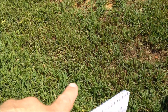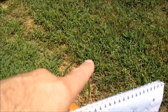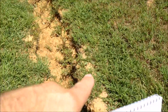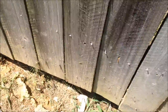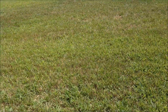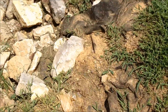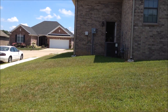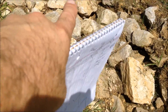Over here on this side we'll put another grate. A little farther down we'll put a third grate to accept all the runoff — there's another pipe there. That pipe will have a four inch pipe that'll come down and just after that grate it'll Y in and run down the property. We'll have another grate right about here, another grate here, and another grate here. My neighbor's water is right here so it'll run in and Y in just after the last grate. Then we've got another gutter right there which will run down — four inch pipe — and we'll Y in right here. I've got one final pipe at the corner of the house that I'm going to run in and we'll Y in just before we end the pipe.